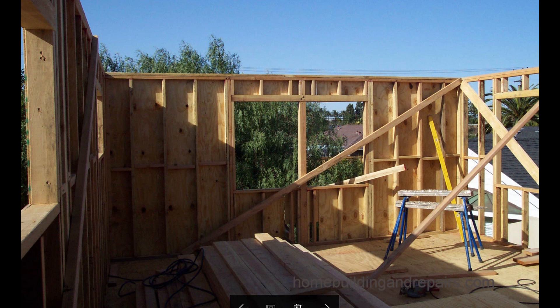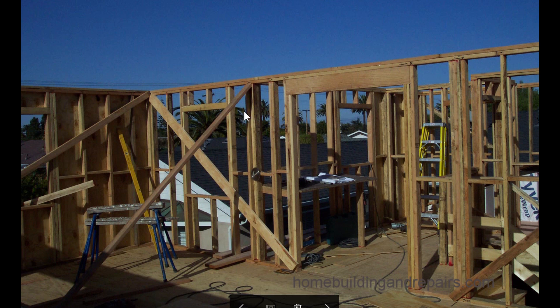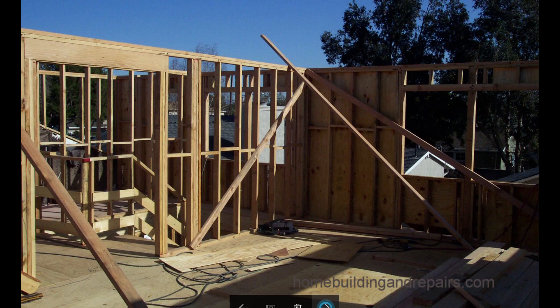Let's look at what it would look like if we were bracing a wall while building a house. Before the shear panel is applied, we install braces — you can see braces on every wall. This levels the wall, plumbs it up, gets it nice and straight, and prevents it from moving. These braces would just go on your support wall, and of course you would remove them when you're done.